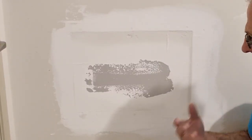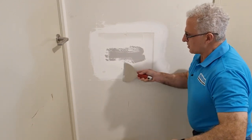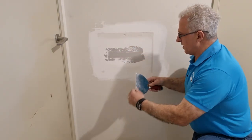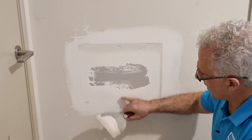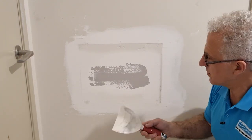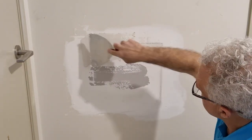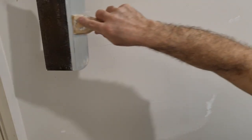The base coat is now dry and ready for a second layer. I just need to slide the scraper across lightly to knock off any rough edges — don't dig in. Now putting on the second layer — as you do each layer you've got to go wider and wider every time. There's where I went last time, so I'll go a little bit wider. On the last coat I'll use a really wide trowel to take all the excess off. You won't be able to get all the lines out, so just get as best you can — we'll get those out when we do the top coat.